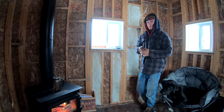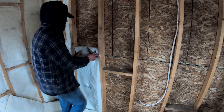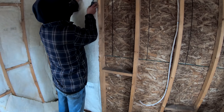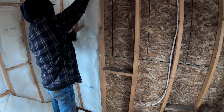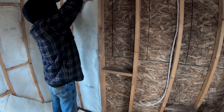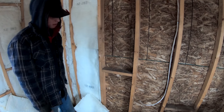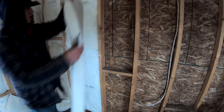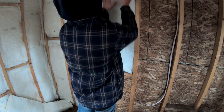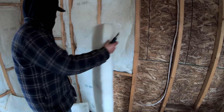We'll keep cutting pieces. I'll show you some on my back wall — these are all 16 on center so easy to do here. Get these lined up — this is R12 insulation. We'll be left with some smaller pieces on top, so we'll do that stuff at the end and use up some of our scrap.